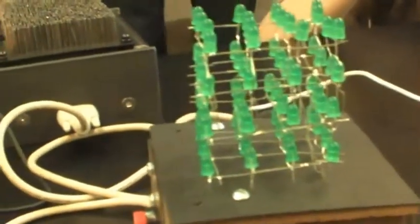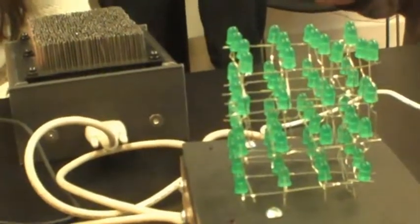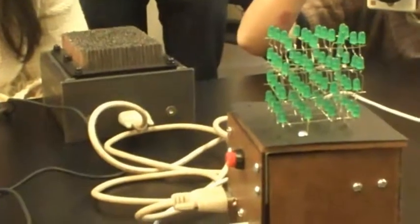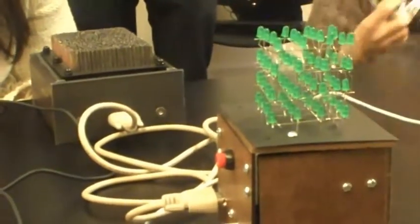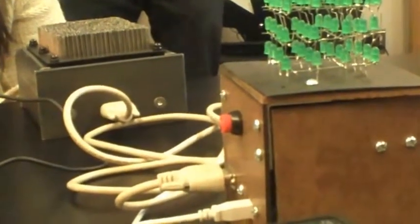Yeah. So there was a backwards LED, but fortunately it was on the outside, so we left it in there. Amazingly, it works. I was very careful, because you can see the anodes as they go down. They have to go around the LED below it, so it took a lot of soldering and small needle-nose pliers to put them in the right place. And good use of helping hands, and a long time in the shop, waiting till I clean up all night.